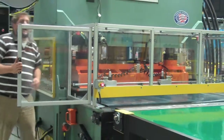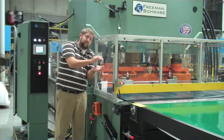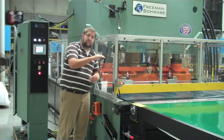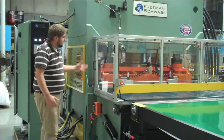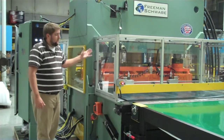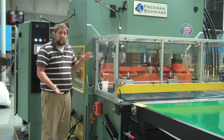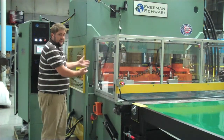That creates a mass deflection scenario. Every press has a little bit of deflection — most flex opposite. The SR flexes together, so you always have the same gap between the head and the bed no matter where you're at in your cutting cycle. Because of that design, the SR develops full tonnage throughout the entire stroke, with no linkages to get caught up with. You have full tonnage for the entire stroke, which in this case is eight inches.